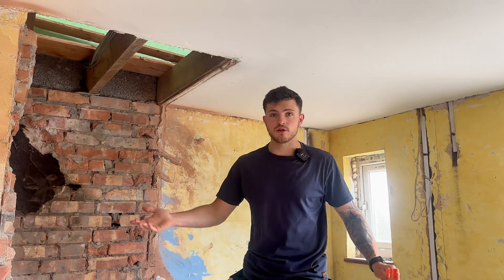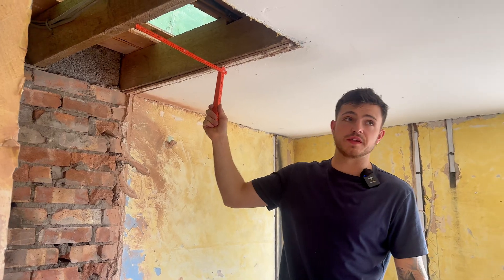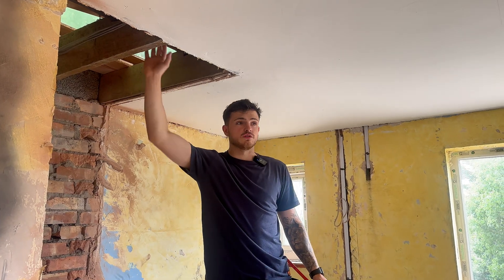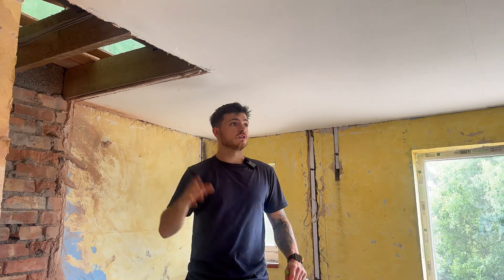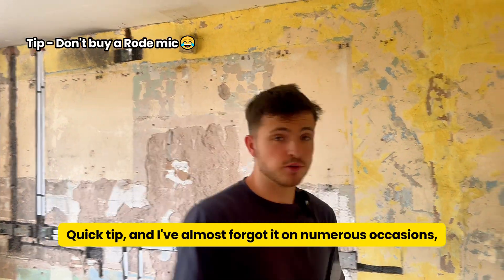Right, so we're doing the spotlights in the kitchen first. Perfect for us really — we can see the joists and we're just going to measure what they are. These are on 400mm centres, so we can mark the ceiling with the joists so when we're marking our spotlights we know if we're going to hit a joist or not. That's the worst thing about spotlights — if you're gonna hit the joist after you've marked them all out, you drill the hole and think 'oh no'. We're lucky — mark all these out, get the laser line set up and then we're on to a winner.